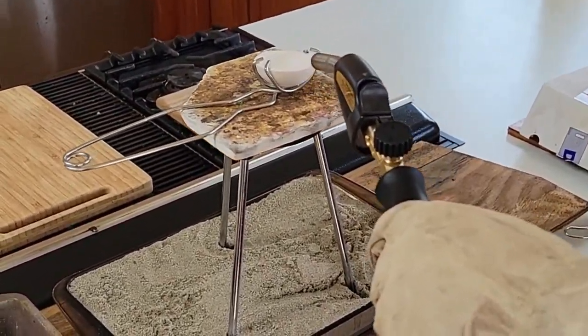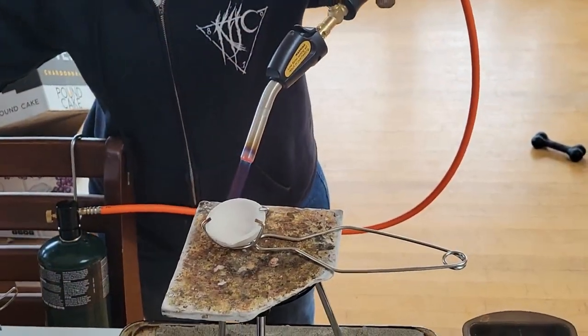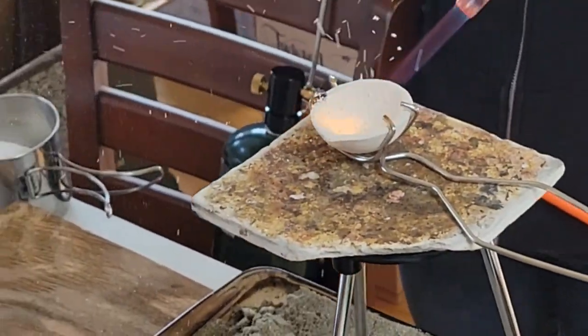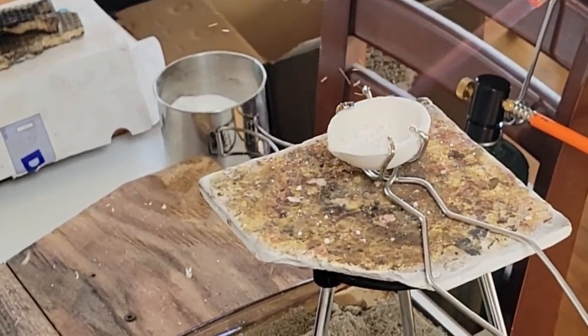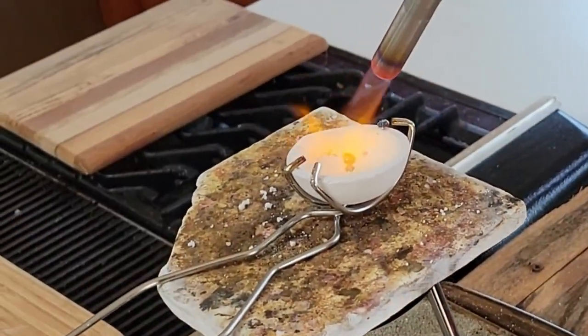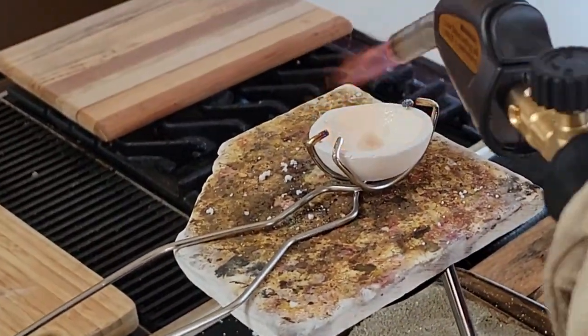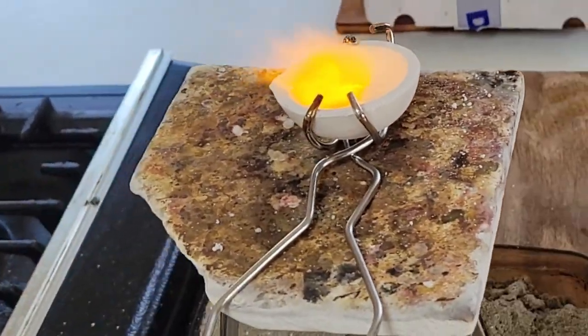In order to use this crucible to meet our maker's vision, we need to cure it to strengthen its ceramic form. This is done with a heavy dose of fire. To further prepare this crucible, you add borax that melts into a glaze, and that prevents the melting metal from sticking to the walls of the crucible.